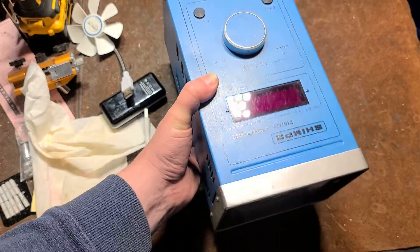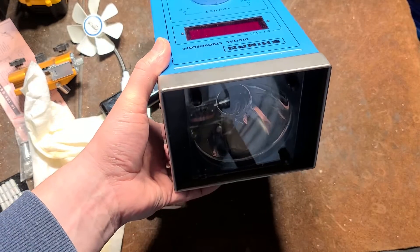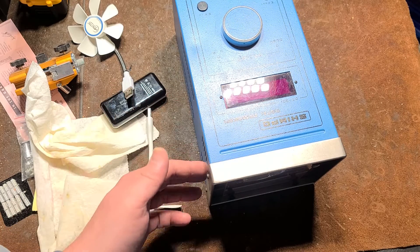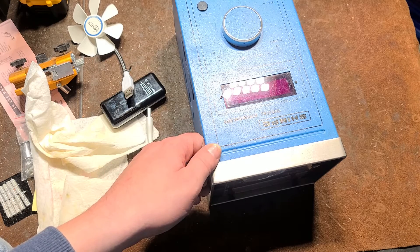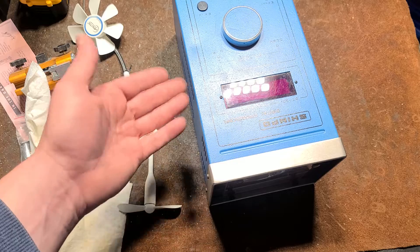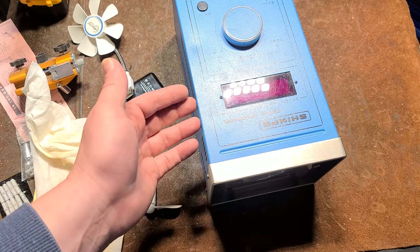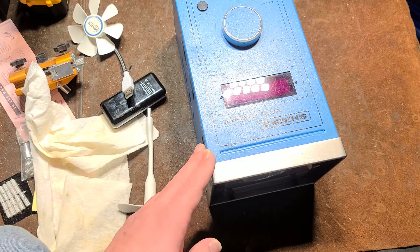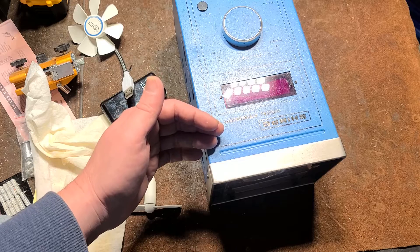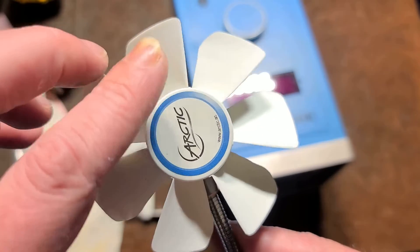I'm going to wait to open it up until I can order a new strobe capacitor and bulb so it runs brighter, but it's a testament that it still runs just as it should, decades later. Once you have one of these it's surprisingly handy — it's much easier to measure RPM by pointing a flashing light at something and turning a dial. No stickers needed, no getting close. The readout is simply calibrated to blinks per minute, which gives you the RPM.